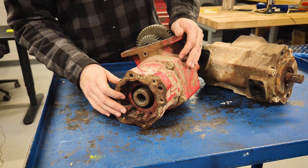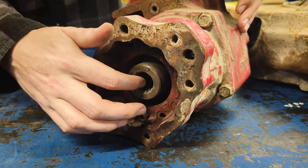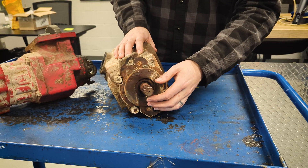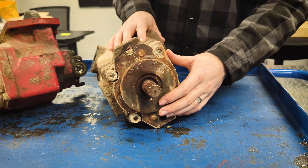This is an example of what an output shaft can look like on a PTO. On a Baylinks unit, you're going to see a lot of this spline shaft style as well as a keyed shaft from time to time. This is what the spline shaft looks like on a pump. As you can see, this will fit into the output shaft on a PTO.